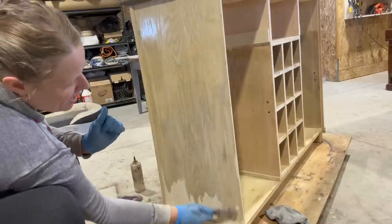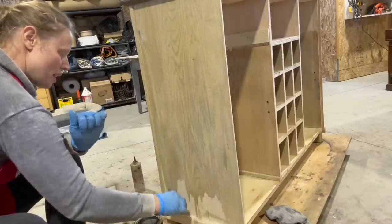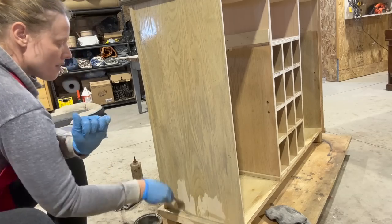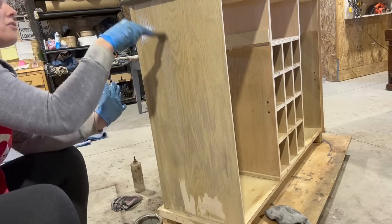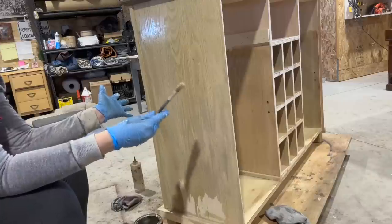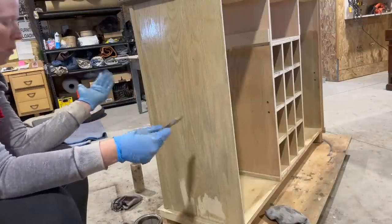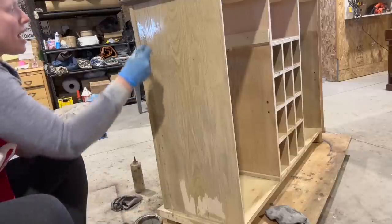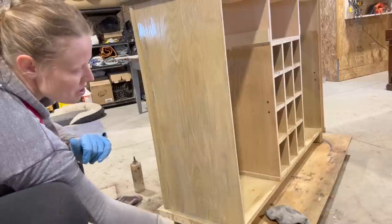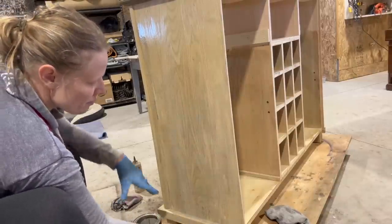So that is why I use my stain brushes like that. If I were brushing varnish, obviously I would be more carefully moving across the piece, because that's my finish, and you have to make sure you're careful about the brush strokes. Stain's gonna get wiped off. Just get the color on, wipe it off. It does not matter what you do with your brush at this point, unless you're using a color mixed with a finish. Go nuts, people.